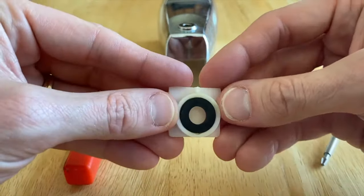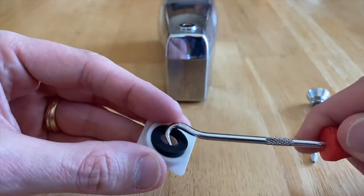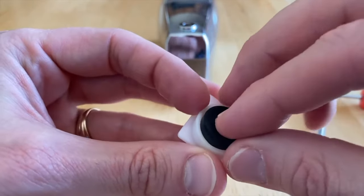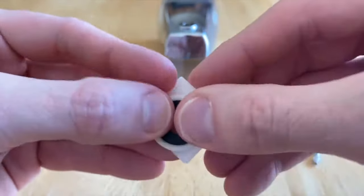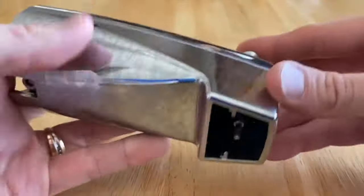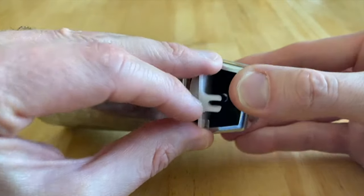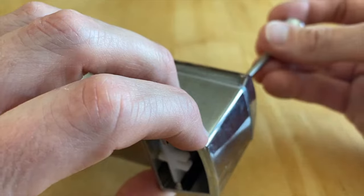The next piece is this piece right here — this is what your rod grabs hold of inside your spout — and this rubber grommet gasket has to be in there. In the event that yours pops out, the inner portion is the cut portion. The way this goes in is: put that side in so it is flush on the bottom or inner side, and the outer surface is the surface shown here. Once you put the actual pull inside the hole, it comes down and you'll notice two little notches or tabs. This piece is going to slide in place inside here, with the rubber gasket on the opposite side of your pull, and that little hook is actually where this little groove rests inside. This might take some patience and time to align properly.